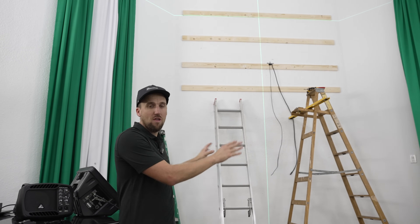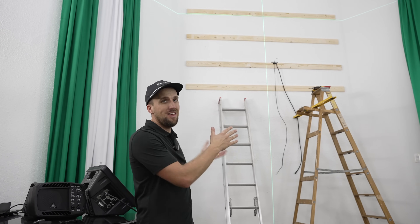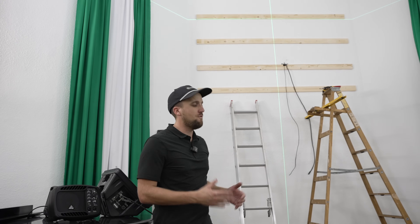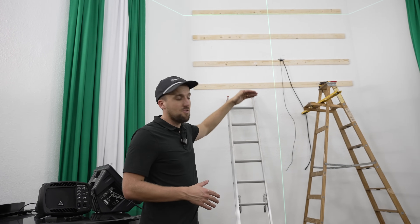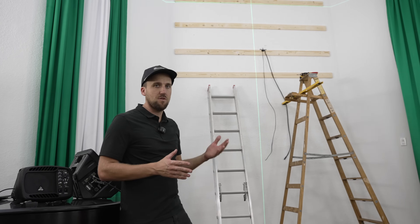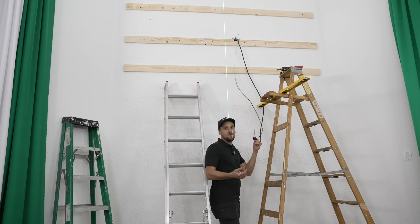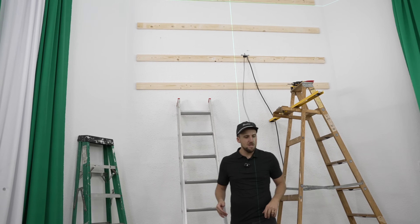We just completed a very important step: getting our wood backing on the wall. These are the 1x4s and we carefully measured out their placement, then anchored them into the studs behind the drywall using four-inch screws to make sure there's no issue holding the weight of this screen. Now when we go to install the cabinets, smaller screws will fasten the cabinets to that wood backing — safe and secure. At this stage it was also important to pull through our data and power cables so that once the cabinets are up, we can fish the cables through the holes in the cabinet and plug them in.